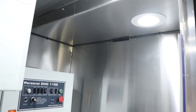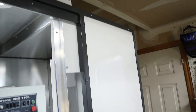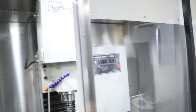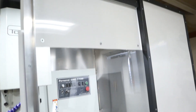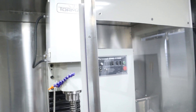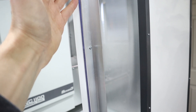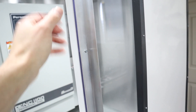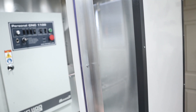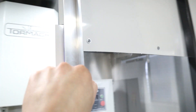I've got that side panel in, and that's kind of what I was just showing you there. And then I've got this side panel in, and then I also have the door that I made. So it's just that piece of polycarbonate and then a piece of sheet metal. I bought a piece of angle — this is aluminum angle, only a sixteenth inch thick. I wanted something thin and light. And then I just used a piece of sheet metal right here with a little bit of a bend on it. The plan is to have the other door come in front of this, and this will act as a seam or a guard to keep coolant from coming in between the two door panels. And then, of course, the angle is there for a door pull — just something simple.